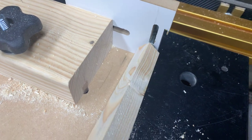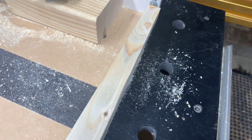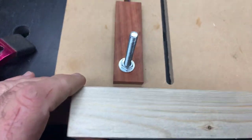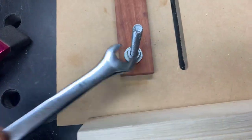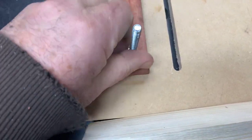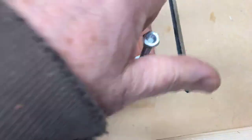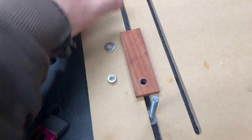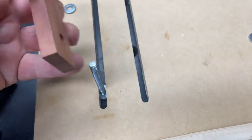As you see it spins around, it's always going to stay the same. Obviously it's spinning around up here because it's already been pre-cut, but when it hasn't been cut you have to pull it back and realign it again until the angle starts to work out so you can just spin it. You use this as a stop lock, and I use this with a lock nut here — the lock nut is a way of keeping it fixed. So I made this block with a referencing point that can slide back and forward in that track.